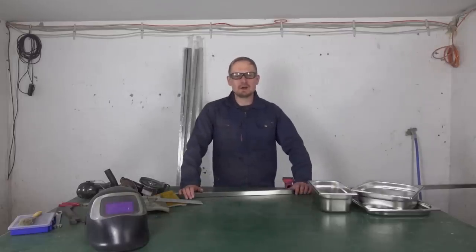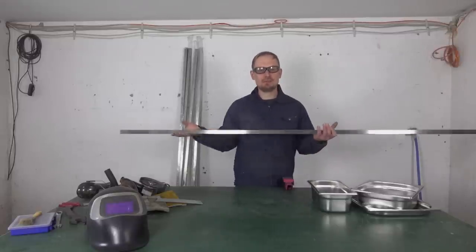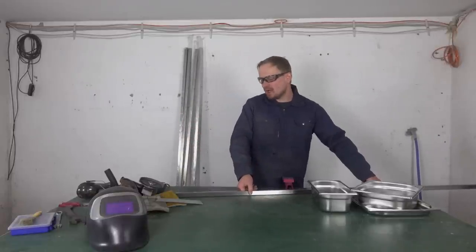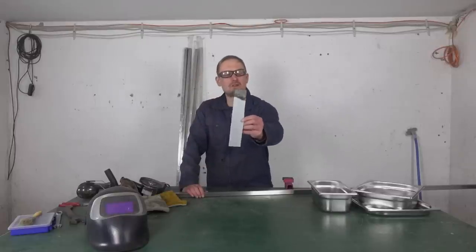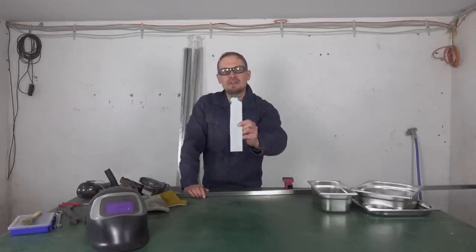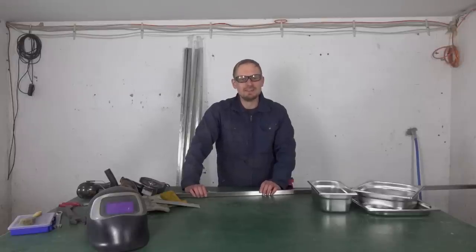All tools are in place and I can start to build the table. I ordered some square tubes of stainless steel, 25x25 mm and 2 m long — I have 5 of them, so 10 m altogether. Why stainless steel? Because the paint thinner and the paint gun cleaner cause a lot of corrosion. Here I have a piece of zinc-plated steel that I left in paint thinner for a while, and as you can see it corrodes very easily even with the zinc plating on it. So the only option is stainless steel, because you can't paint your table when it's ready — the thinner will wash all the paint away, and powder coating will also be harmed.